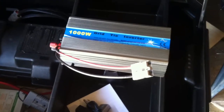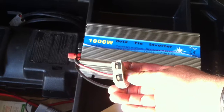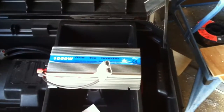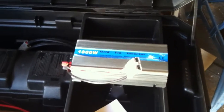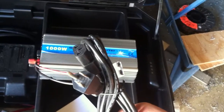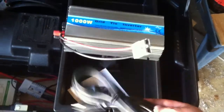What I've done here is install a relatively short cable with the type of plug I've standardized with my system off the panels. I have a relatively short 10-foot extension cord so I can park this box in a water-resistant container. We don't want this out in the rain — it needs to be technically indoors, or at least in a small shelter. Then you run a standard power cord from this plug into a regular 110/120 AC outlet. It uses a computer cord, so if you ever lose it just get a three-element computer cord.